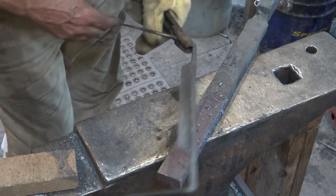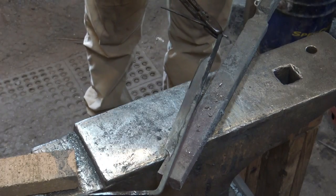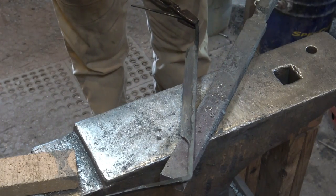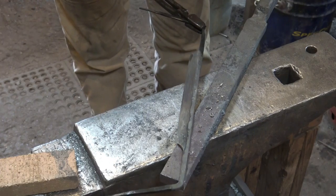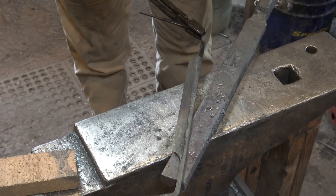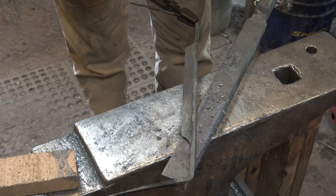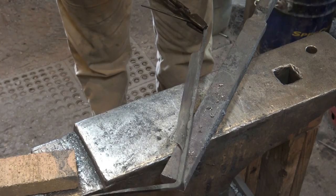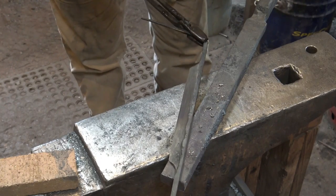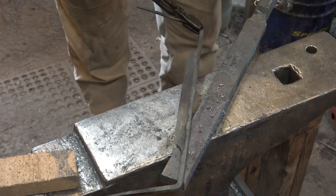Okay, so I'm going to have to try and quench this part and leave the other part out. Not the ideal. So one reason doing this in an oven is so desirable. You can get the whole thing to quench evenly at one time. So I've got just a little purple there, but for the most part it's in that bronze range that I want, or close to the peacock range, which isn't too bad. You can do some of this with a torch. I think it's real easy to overshoot with a torch and get it really uneven because one side heats up while you're not expecting it and something else doesn't get hot enough, and it just can really cause a problem.